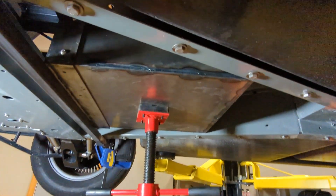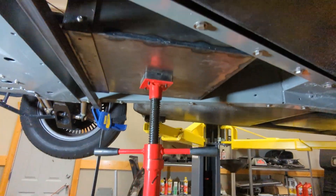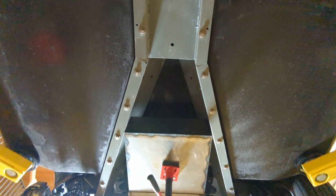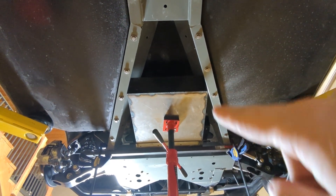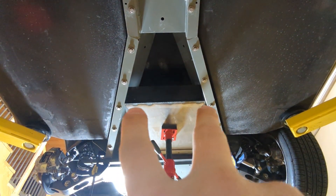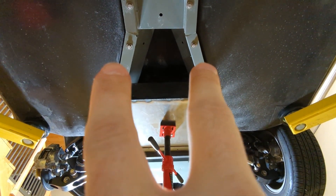So what I need to do is figure a way that I can shift this box back. This is a decent enough angle right here — you can see how much overlap there is. That is one inch right there, and I'm going to try and get myself two inches. So I want to move this back two inches, and it really shouldn't be that difficult. Because of the way that this is angled, this is a pretty sharp angle — as it turns out, about 71 degrees. So what that means is that for every inch I can shave right there, I can add three inches this way.